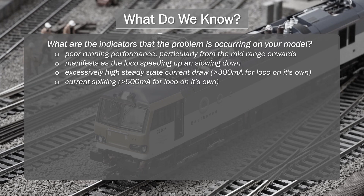You see high current spiking, typically in excess of 500 milliamps, and I've seen it all the way up to 900 milliamps — and this is with the locomotive running on its own. Some people have commented that they noticed a noticeable warming on the model, and if you did run it in this state for a period of time, you will see some warming and ultimately potentially other failures occurring.